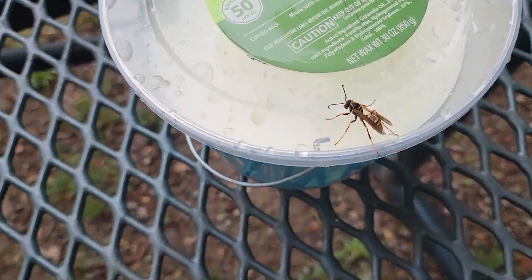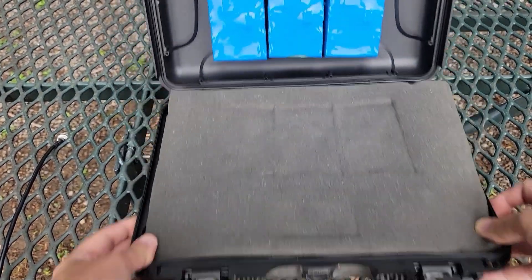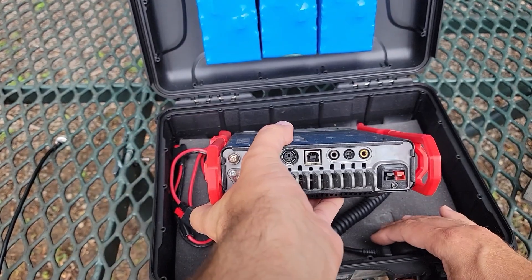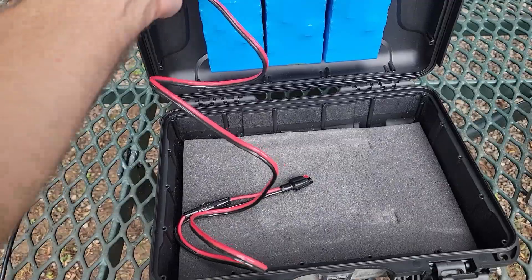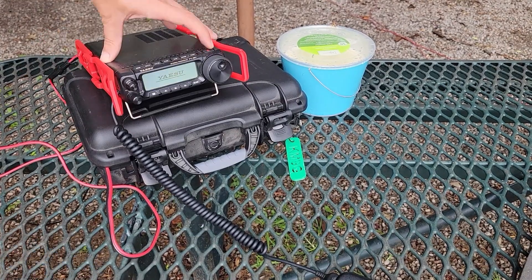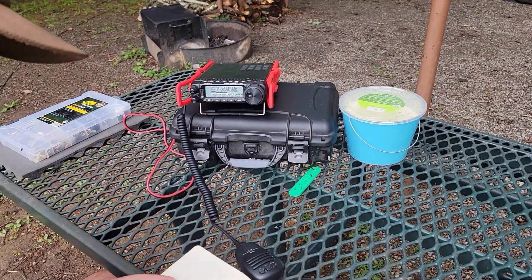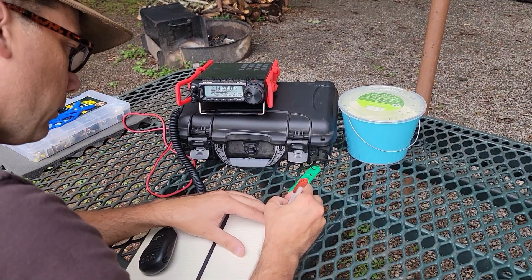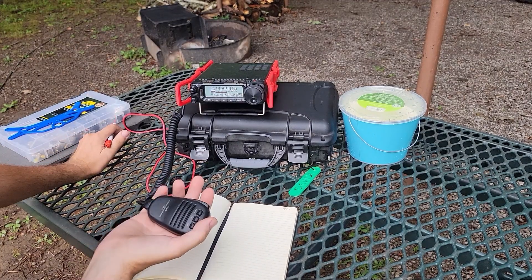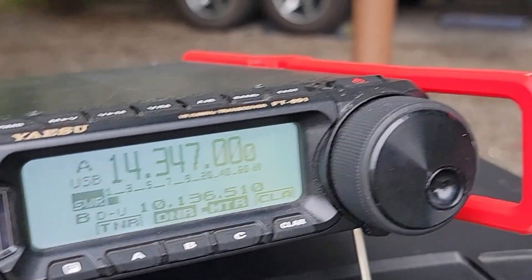At least they have normal size wasps here. The Yaesu FT-891 with the Denko 9 amp-hour special in the lid. There's the 891, the power cord, and the mic. This one has the power pole modification on the back of it, so I'm going to get this thing set up real quick. Checking the frequency — is the frequency in use? KM9G. We're at about 1.4 to 1.5-to-1 SWR, just like we saw in the Nano VNA. That's great. Checking the SWR on the top side of the band — a little under 2. It's not bad.